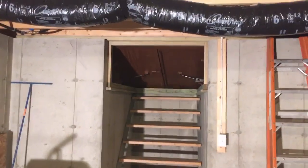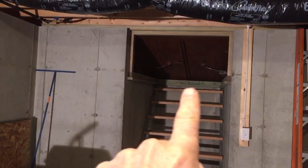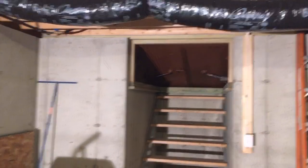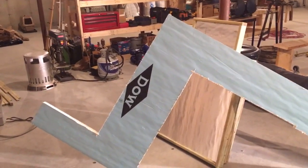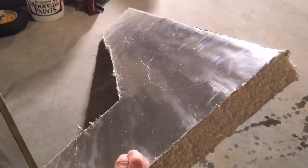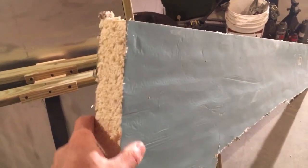The recognized solution is to put in a horizontal panel here. You can see where I've taken some pressure-treated wood and ram-set it into the sides of the foundation. I'm going to show you what these panels look like. I created three panels using this R13 Dow product — it's two inches thick with an aluminum foil covering on one side and a plastic covering on the other. It comes up to R13 and it's a bit more durable than plain styrofoam.